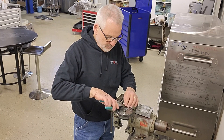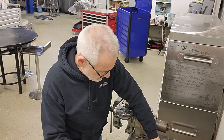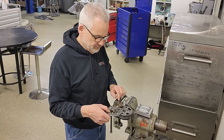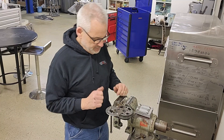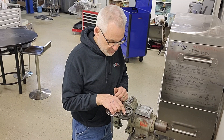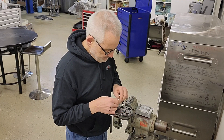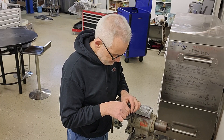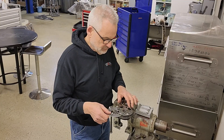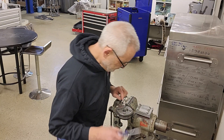Coming around the spring, we just rotate this. Then we can look in the VCT unit and you'll see one cavity that looks a little bit different — it normally has a numeral, and you can see two stops. We just take the wedge and drop it in there. Then we slide this back, and it's almost that easy.